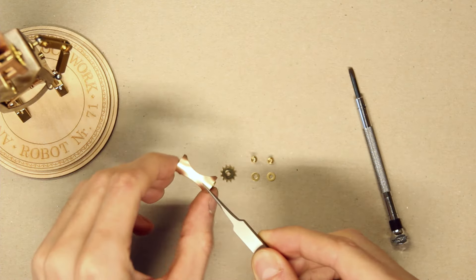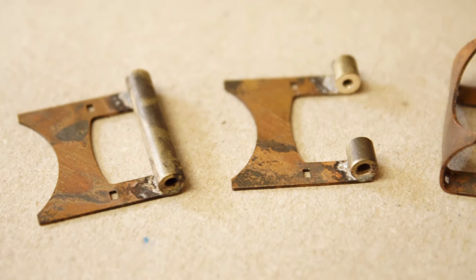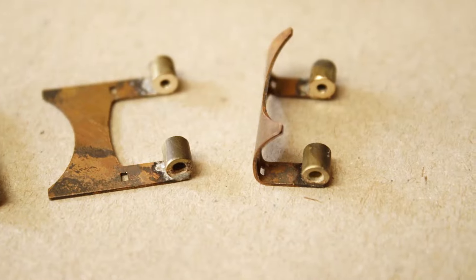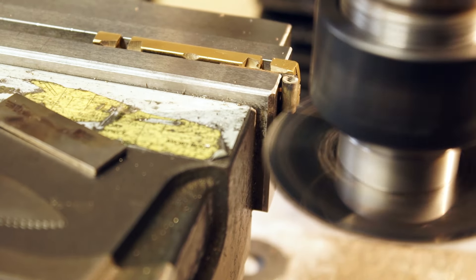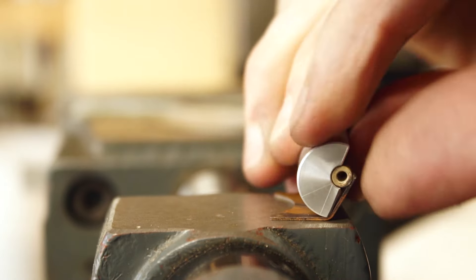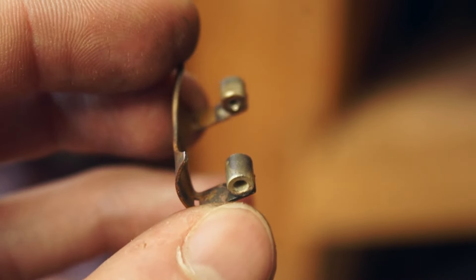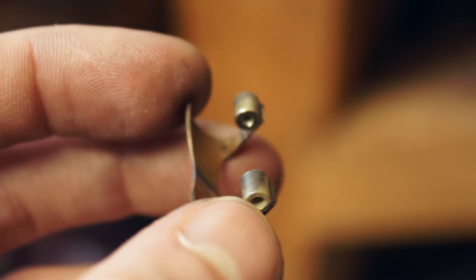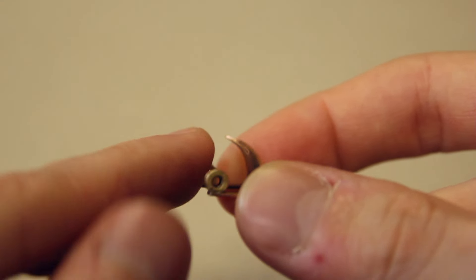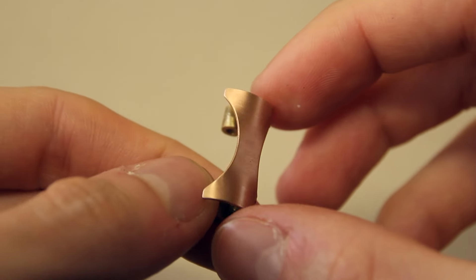This oddly shaped mouthpiece was fairly straightforward to manufacture. It started off as a laser-cut piece of bronze sheet metal, and I silver soldered a piece of prepared brass rod onto the ends. I manufactured it in one piece and then later cut out the centerpiece to make sure the two little hinges are aligned properly in one line and at the correct distance. I also made a little aluminum bending aid to get it into the right shape. The inside was nearly impossible to polish, so I left it in its rough oxidized form from silver soldering and just polished the outside — which also gives a bit more of a handcrafted feel.